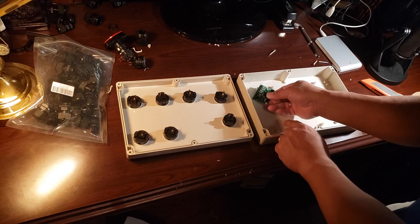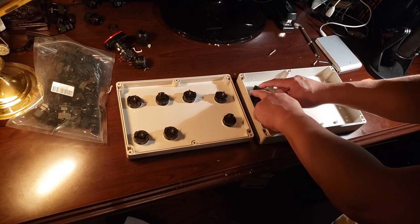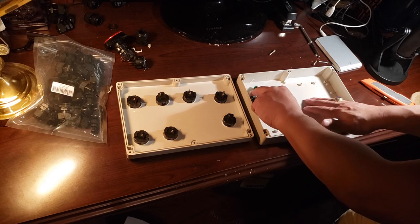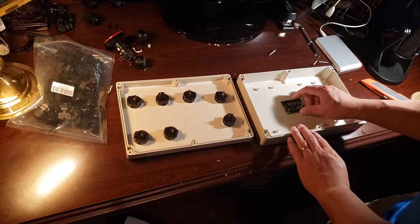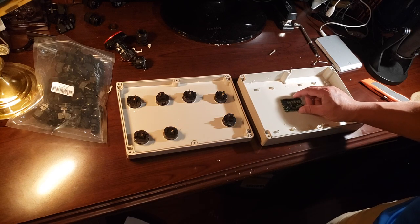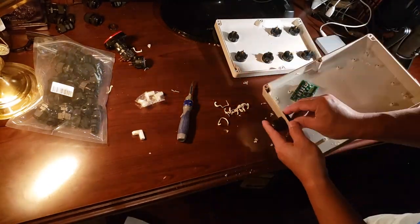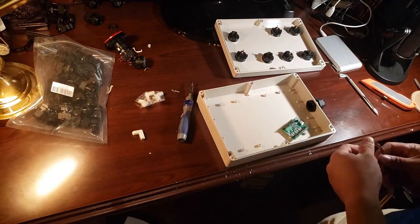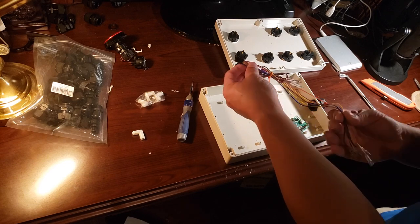Some thought needs to come in here — you don't want things to be cluttered in the same area. A little bit of cable management goes a long way so you don't have things touching each other and potentially impacting signals. Next we go ahead and drill the hole for the USB cable to go through and mount the cable gland, then we're going to connect the wiring to all of our buttons.